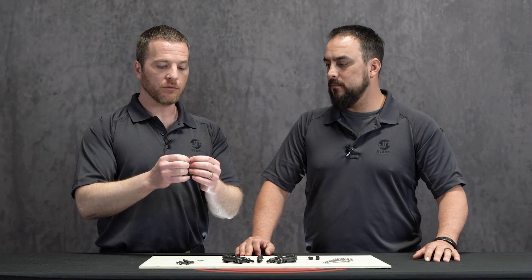There's a slight difference between the Armalite style and the DPMS style .308 bolts — it is more keyed towards that DPMS LR-308 style bolt. And then the small frame ring, which will work on any of the small frame bolts we have: 6.8 SPC, 6.5 Grendel, .223. It's great to have a couple in the bag — it lasts a really long time, and it's super cheap and super easy to get in there. Don't let your friends know you have it at the range, because their gun will fail eventually and they're going to want your one-piece gas ring.